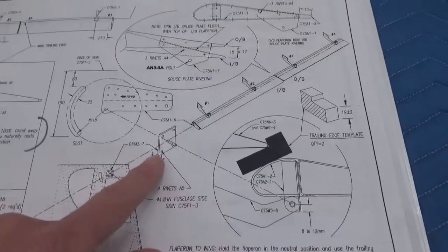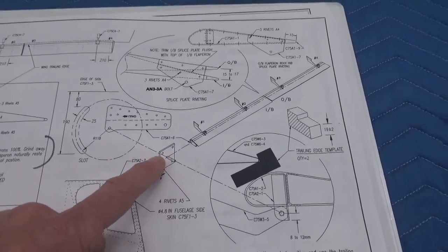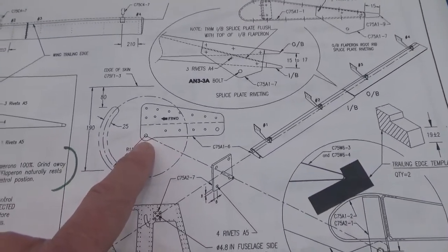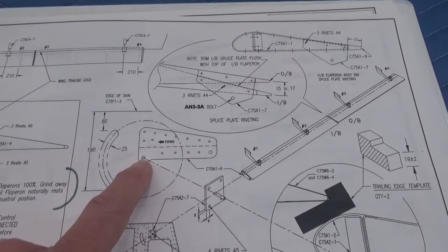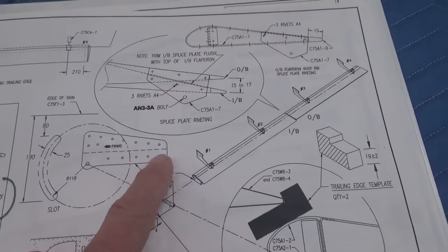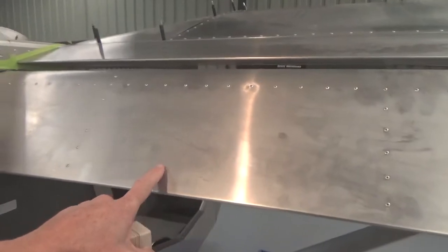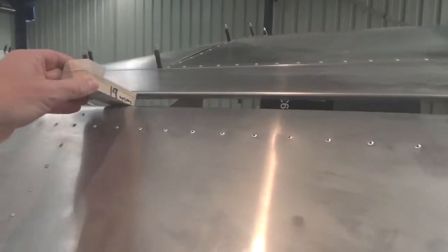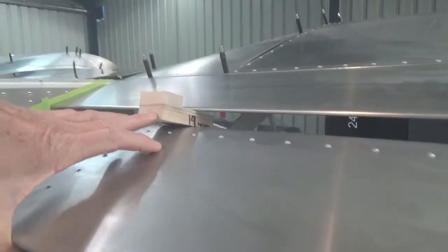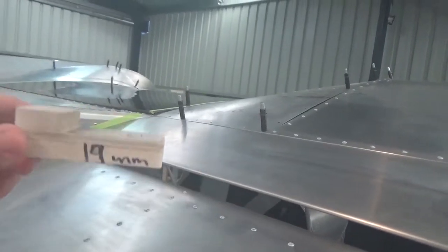But I'll show you that installed on the aircraft. While we're looking at the plans, the other thing is this reinforcing pin or plate, which goes on the inside of the fuselage pointing outwards, and connects up to the forward pivot hole at the trailing — or the root — of the flapperon, with the main input rod going in here. So I started with the inboard flapperon. When the flap's up or roughly neutral, the 19mm block goes in there and will run along nicely, so you get your 19mm slot.